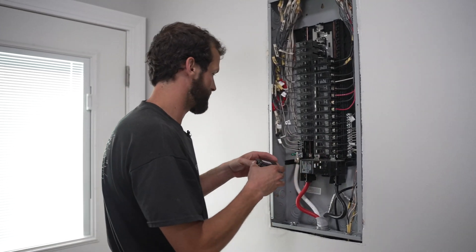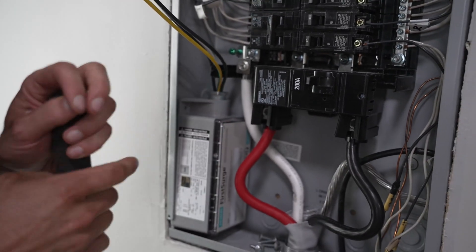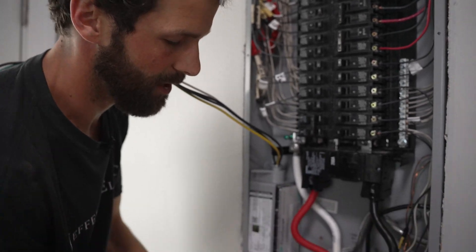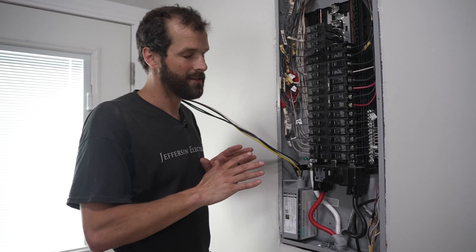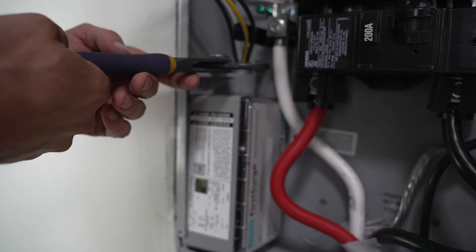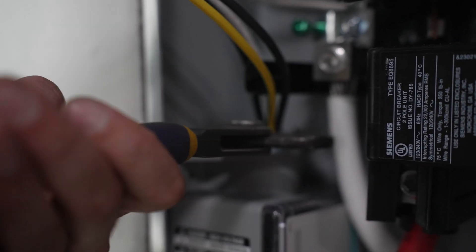The Siemens FS140 is recommended to be installed on a two-pole 20-amp breaker. We're going to be installing this inside the electrical panel. A couple tips and tricks — pay attention, this is really important. One, there is a flush trim kit if you wanted to install this below or beside the panel. Below, that flush trim kit is good for less visible locations, but aesthetic concerns in this particular location make it a non-starter, so this is going fully inside the panel. Two, I've got a threaded top to this surge protector that takes three-quarter inch standard threads. I have a chase nipple in there as a bushing for those wires so that they do not chafe on the threads — that is now tool tight.